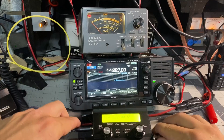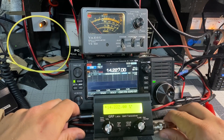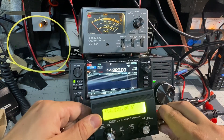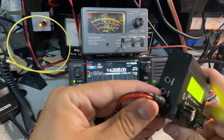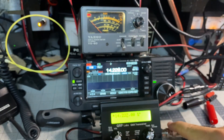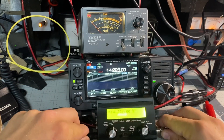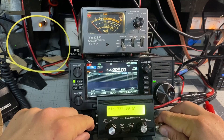I really enjoy this little radio. I said I wasn't going to sell my last one, but I ended up selling it — just like everything else, it always seems to come and go. I might sell this one too; I haven't decided. I really liked the high bands on the other one. One downfall is that it does not have a speaker, but an external speaker or headphones can be plugged into the audio port. This radio will have a built-in PTT, but it is not active at the moment. Don't give it any more than the 12 volts recommended — not 13.8, not 14.6 — 12 volts only, or you will fry it.